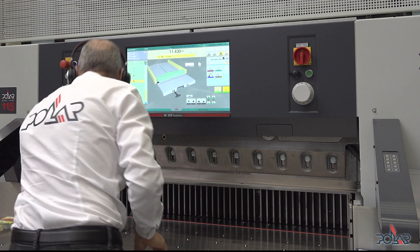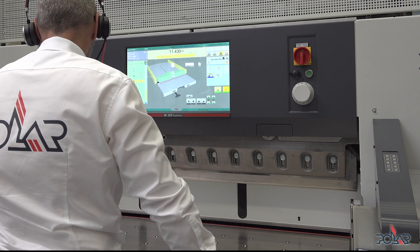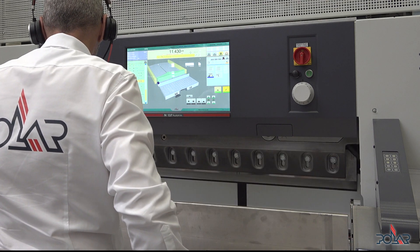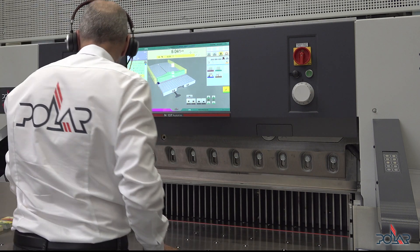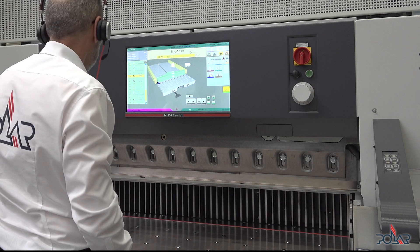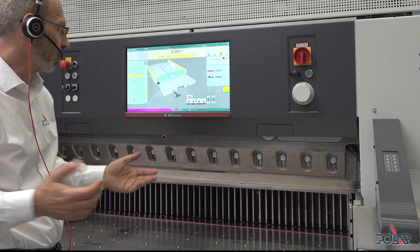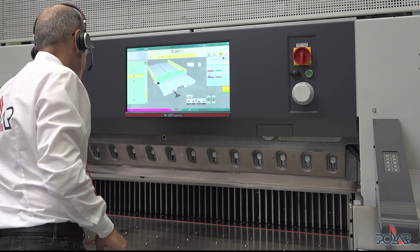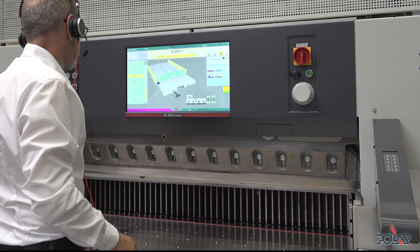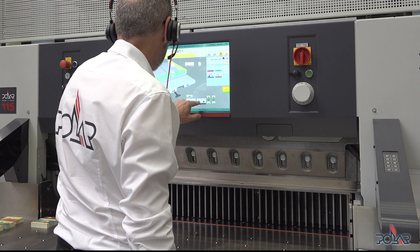So last two cards, I'm almost ready. The size is too small — the back gauge is stopping. This is a normal situation when cutting very small pieces like this, small tiny cards. The cards are just 5.4 cm, so I have to take out the false clamp plate.